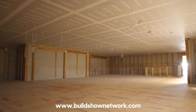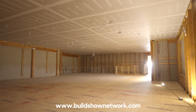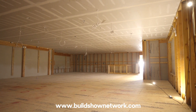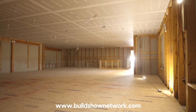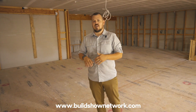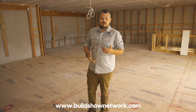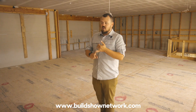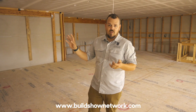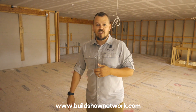We have big patio doors going here, big 10-feet-wide windows going in some of the other spaces. The reason we haven't cut them out yet is we're working really hard using that as an air barrier to be able to test our methods, make alterations, make changes. The way you test your air barrier is a blower door — we own our own blower door — so we're going to test multiple times. Our first test, we're going to test at this stage. That's why the windows aren't cut out. We're going to pressurize and make sure the envelope is what we want it to be.